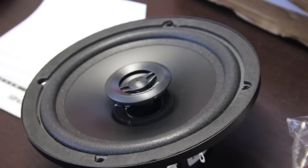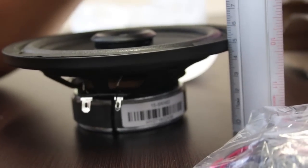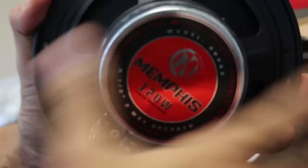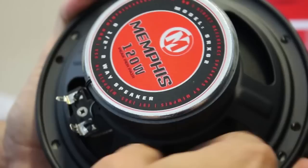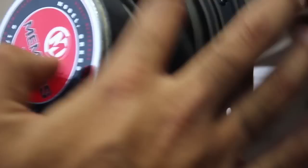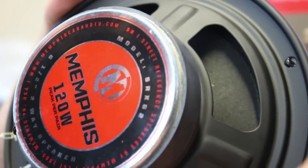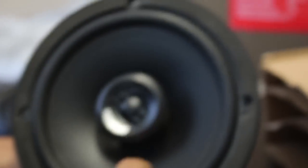Checking the mounting depth, we have a very good mounting depth. The basket materials are very good and come with a coating that prevents corrosion. And then the cone — what caught my attention is that it is made from paper. It is something very good; a paper cone, from my point of view, manages higher quality than plastic. It is less durable, it is true, but with the reinforcement we have greater durability — it could even be double.